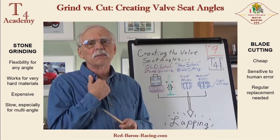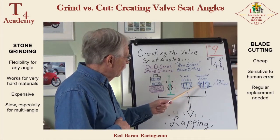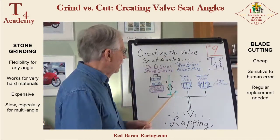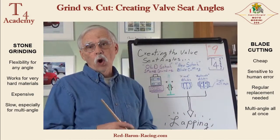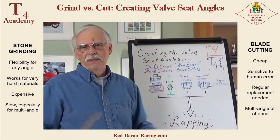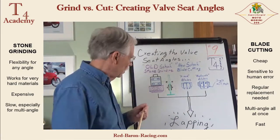The way that professionals do it today, especially if you're building very high-end race engines for Indianapolis, NASCAR, Pro Stock, or the dragstrip, is you'll use something by a company called Quickway as one example. They make very stiff, strong blade holder heads where the blades are replaceable. When a blade gets dull, take it out, put another one in, and keep going. Also, you have the ability not just to cut a single angle but multi-angle all in one pass — you can get cutters that have the 60, the 45, the 30, the 15 already made into the cutting edge. Put them on, go around, done. If you've got a V8 with four valves — that's 32 valves in all — you'll be done with all 32 by the time you get two done with the stones, if everything is set up properly.